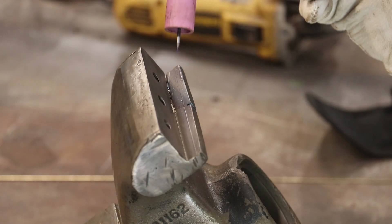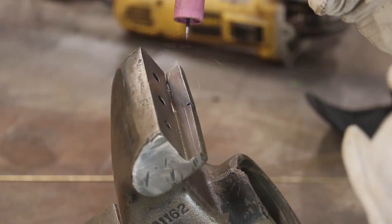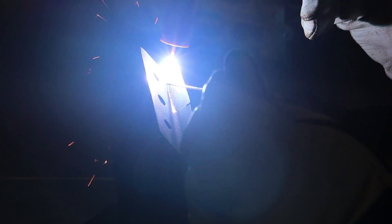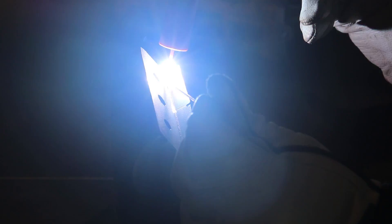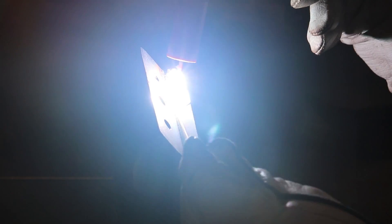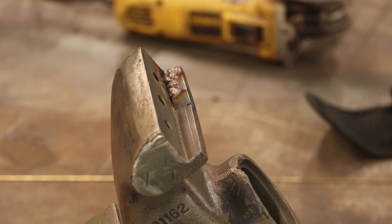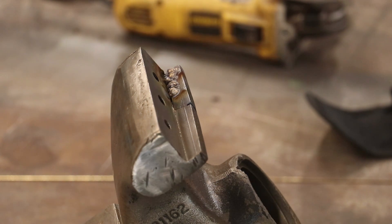I'm going to go ahead and hit it with some argon first, kind of flush it out. We're not trying to melt metal here - this isn't like normal welding. I'm just trying to get it hot enough to get this bronze to kind of go down in there and seal this hole in. I'm really having a hard time seeing this. I'm trying to do it where you guys can watch and I can do it, but I may have to get in front of the camera some because I'm having a hard time seeing what I'm doing and it is not looking pretty.